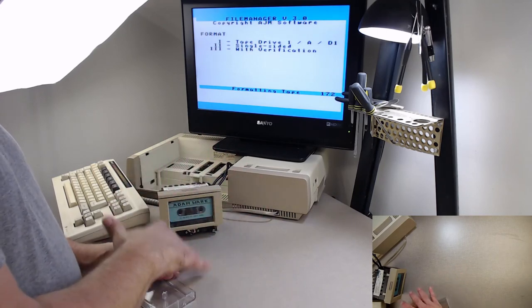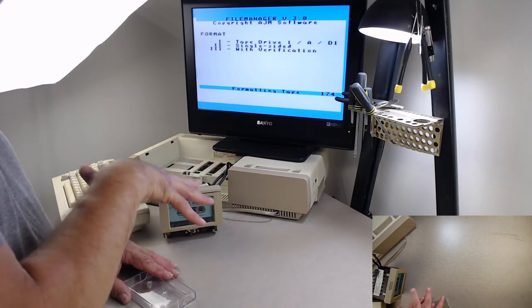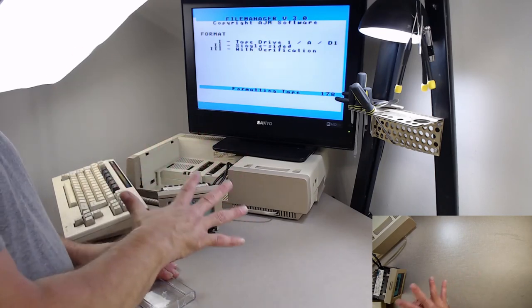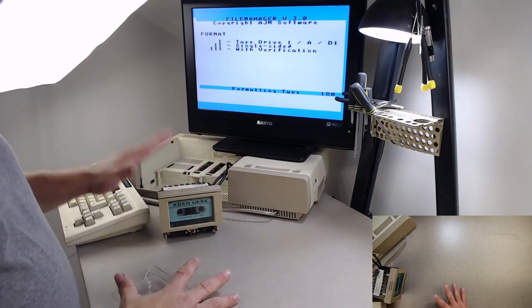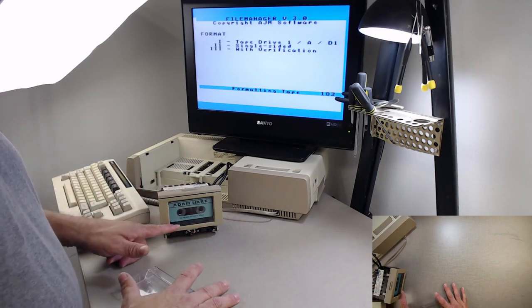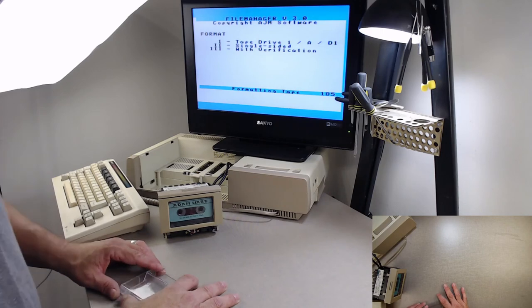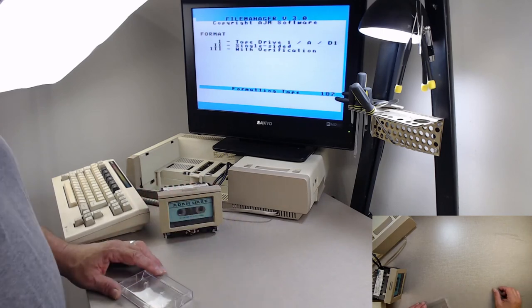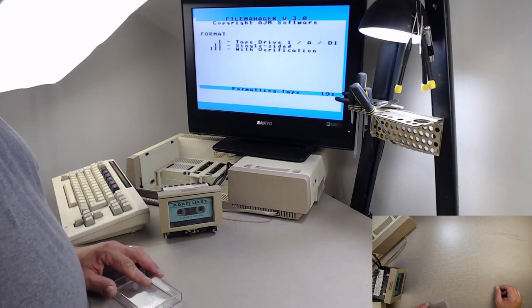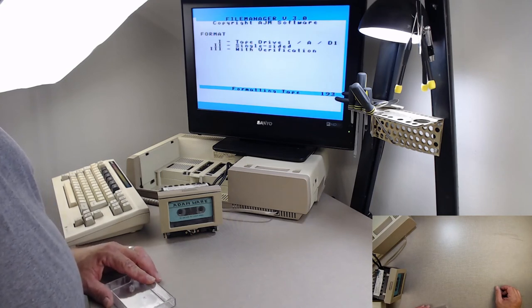If I get a data pack that consistently is in CRC error, or other error, and I format it and it still gives it to me, I get rid of it. I don't mess with bad data packs because I have had too many times where I thought my drive was bad and it was just a bad $1 tape that I converted to a data pack. These are a little bit more than a dollar, but yes, I've had issues with that. Basically, you pull your hair out doing it.